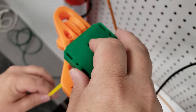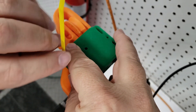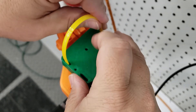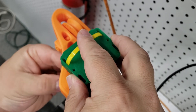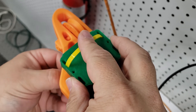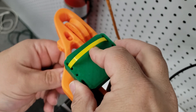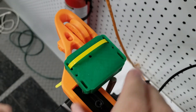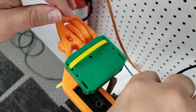The design allows you to hook this onto your 3D printer directly with just a simple zip tie. Something else to note is that you can move this between printers, so if you don't feel the need to run a filament run-out sensor all the time, you can move it between printers — just make sure you update your OctoPrint key so you're pausing the correct printer. I simply strapped this down with the zip tie and then fed the filament through.